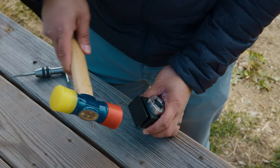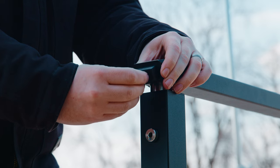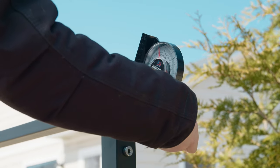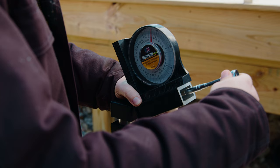If we weren't using our pre-made stair kick out piece, we would need to drill those holes ourselves. Finally, we'll insert the end cap into the other end of the kick out piece, which should fit snugly. Now we're ready to install the handrail between our hinges. We'll start by loosening the nut, which will allow us to make slight adjustments to the angle. We'll take a scrap piece of handrail material and insert it over part C of the handrail hinge to serve as a placeholder while setting the angle. We'll use the angle we found earlier and set the handrail to match the pitch. Now we'll take a 7/16 socket wrench to tighten the nut and lock our handrail in place, using a socket wrench with an extension head to tighten the nut through the handrail scrap so we don't disrupt the hinge. With the angle set, we'll take off the scrap handrail and repeat the same process at the other end of our stair run.